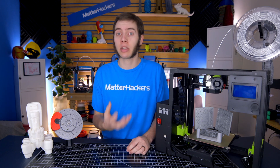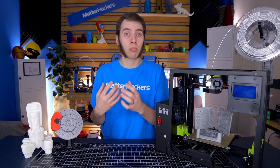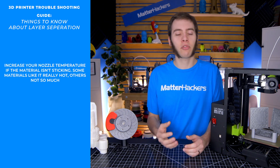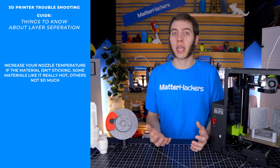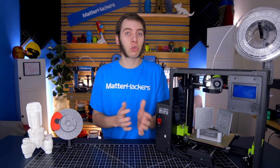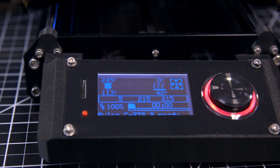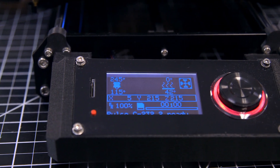Natural PLA has no additives, which means it's the purest form of PLA and might not need as much heat as something with a lot of additives like black, which makes it very opaque. So you might need to play with the print temperatures. Also, if you're printing with a larger nozzle, you'll definitely have to play with the printing temperature. I've printed with the Volcano, a 1.2 millimeter nozzle at 220 — which is the maximum in the range for PLA — and layers have separated. I now print PLA with a 1.2 millimeter nozzle and 0.9 millimeter layer height at 245 degrees Celsius, because that's just how much heat it takes to get the layers to stick together. You may also need to lower the power going into your layer cooling fan.